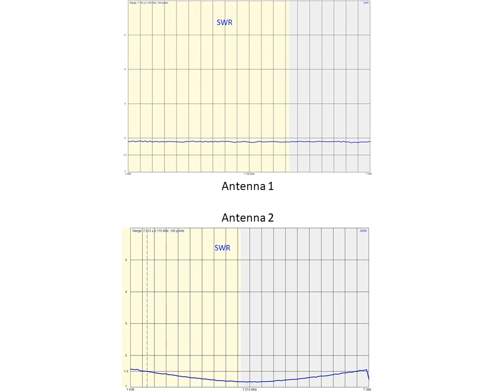So just about anybody that has their technician license can look at these two SWR plots and tell you that probably antenna 2 will outperform antenna 1 because it has lower overall SWR over the band. But then the question is, how much different is it? How much of an improvement would the Hextenna be, or how much do we have to give up in terms of propagation and power if we use the FMJ? And that's where the dilemma comes in, and you can't really gauge that just from the SWR plots. You can kind of see a relative difference, but it's not quantifiable.